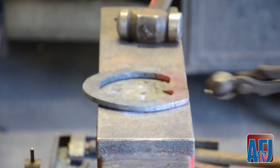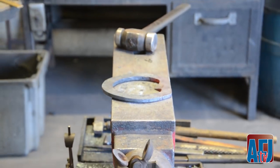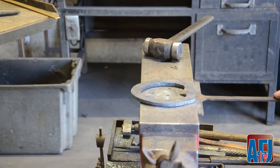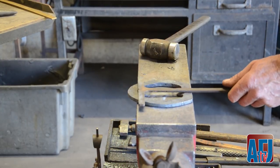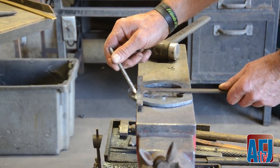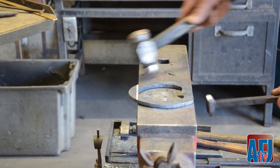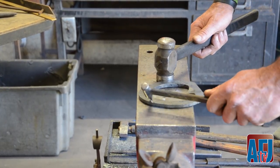So now what do I do? Let me get my T-square. With my T-square, I'm using the bars lined up with this edge of the anvil and the nail holes are lined up with this edge of the anvil - I square everything up. And now, if I put more material in one hockey stick than the other, it doesn't matter because I've straightened it out and I've got the cleanest shape just by using my anvil as a square.